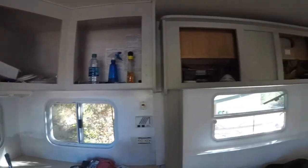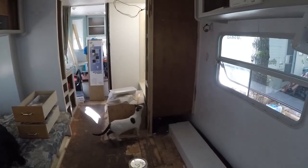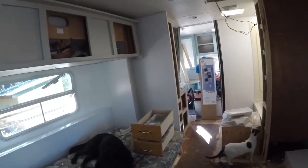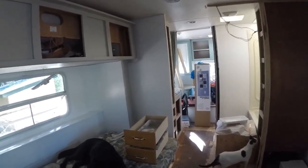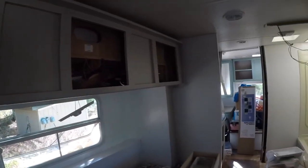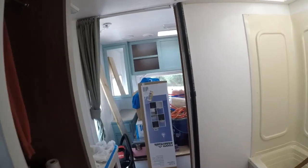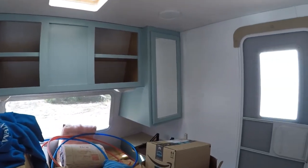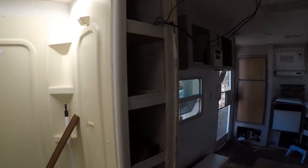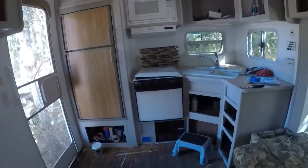Still have a lot of cabinets and doors to paint. I have to wait for the paint on the cabinets to cure because I don't want indentations where they close on each other. In the bedroom, the two doors I already hung are cracked open so they don't seal shut while curing. I'd rather wait until they're fully cured before putting the doors back up.